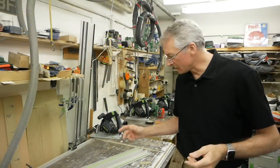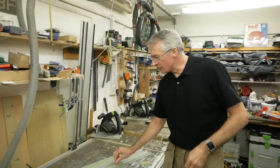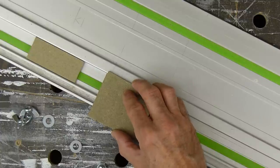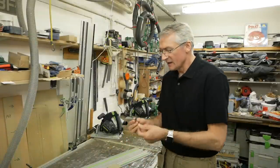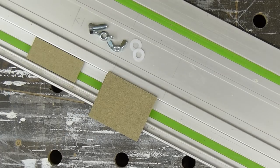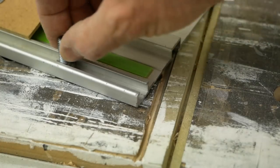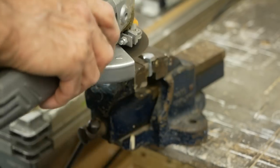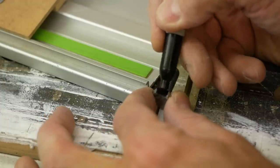To make these little rail stops, it's not difficult. We need a couple of small pieces of MDF that just fit into the trough between the ribs of the rail, and a couple of slightly longer pieces that fit on top of those and overhang the T-track. You need a couple of 8mm bolts with wing nuts and a couple of washers. The important thing is that the head of the bolt fits into the T-track, so I've ground the edges off very slightly and put a little bit of black Sharpie on the ground-down sides so I know they'll fit.